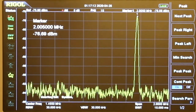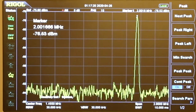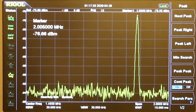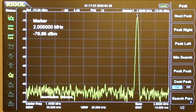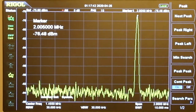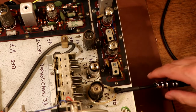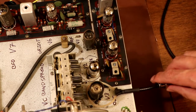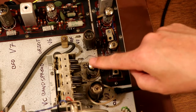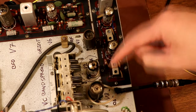I've adjusted the main tuning to 1.5 MHz. You can calculate easily: 455 kHz plus 1.5 MHz equals about two megahertz. The marker on the spectrum analyzer is saying 2.001 MHz — flicking around a little, but damn close. In our Trio receiver here is the local oscillator, and this is a small loop antenna I've got wrapped around the shield can — I'm picking up just enough signal to display it on the spectrum analyzer. So we've just shown the local oscillator running at two megahertz. Here's our mixer valve — it's quite hot, because it's a valve of course.